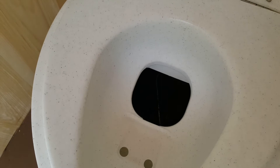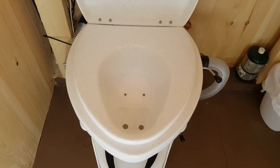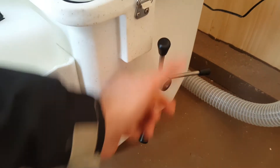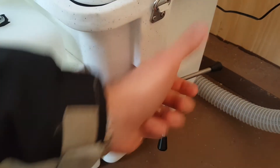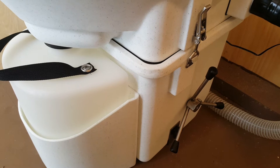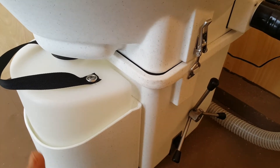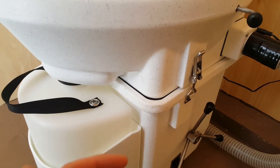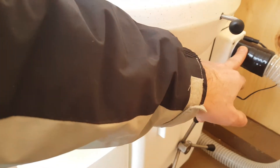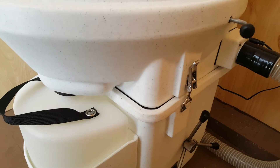There's a trap door here if you're going to be doing number two, which opens up below. It works really, really well. This is the number one bottle, and then below this it sits on a composting tank. You can see right here there is a spider handle, and you can move the compost around inside the chamber. What it uses is sphagnum peat moss — that's all it uses. You put that in there and it's good for, the manufacturer says, 60 uses. Right now when it's this cold, there's no composting happening — it has to be about 55 degrees for the composting to happen. That's why you have this vent fan here — a very low voltage fan that keeps a little bit of negative pressure on this to make sure there's no odor, but also to keep air moving through to help aid in the composting.